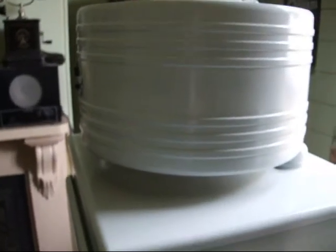The other thing I had to do was restore the cabinet. I mean, you can see I've repainted it with appliance enamel now, but the inside of the cabinet was fairly badly rusted out because the insulation had become damp. You can just see some of where the holes were. It seems to me that it was because of the incorrect door seal that had been fitted that moisture had got in.